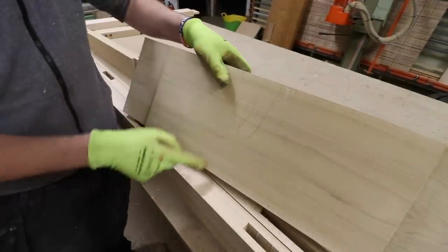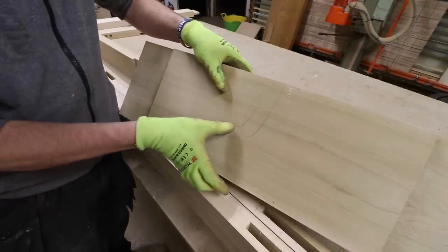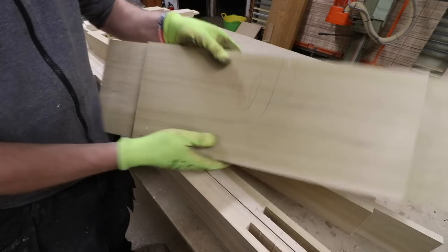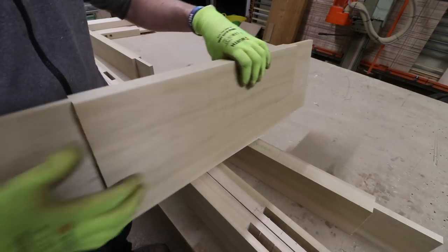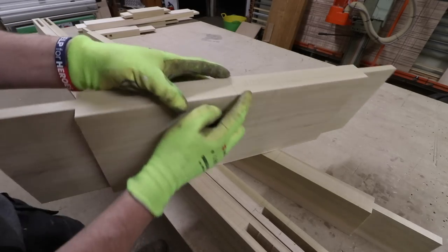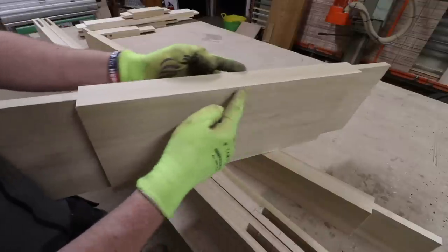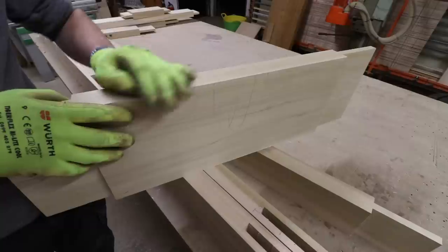But because it's quite a tall rail, the height of the fence that you're clamping this rail against is only about half the height of the actual piece of timber. So there is a chance for the bit that you want the mortise to locate accurately into at this point here, that could move front or back against where the actual fence position is.